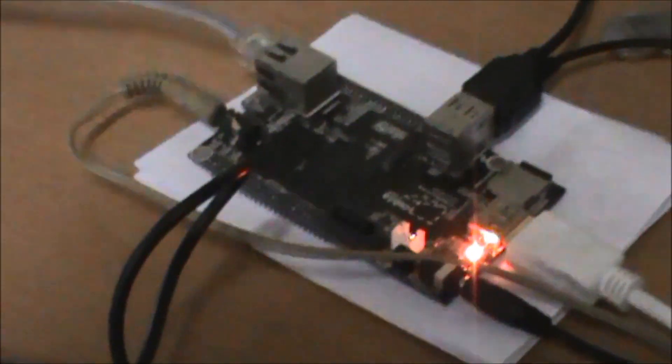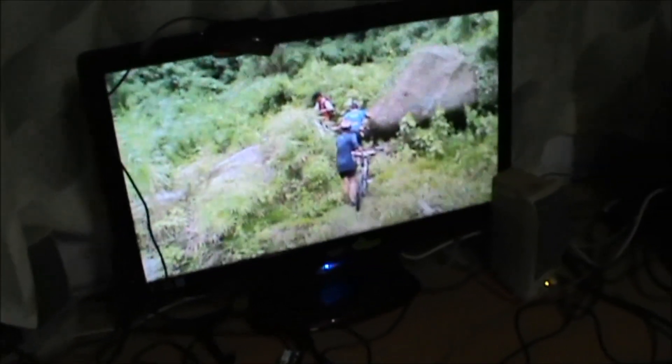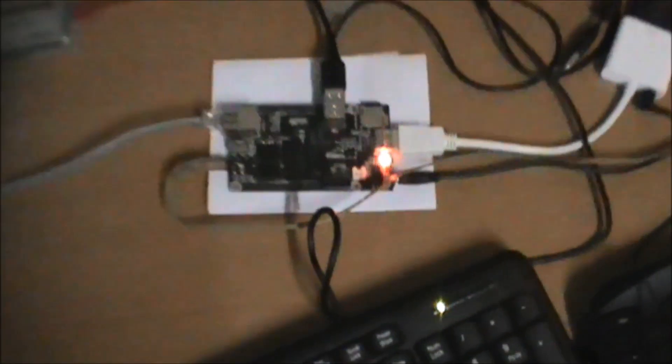This is the workhorse. Both the operating system and the videos are stored on a microSD card — it's an 8GB card. I bought a Class 4 microSD card, so it would probably help to purchase a Class 10 next time because it has higher speeds in both read and write. Essentially, this video running in 720p and previously in 1080p are both powered by this CubieBoard.